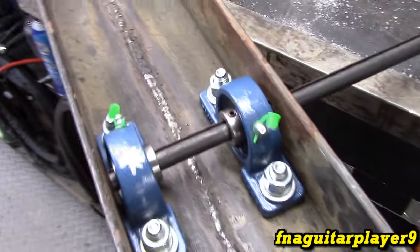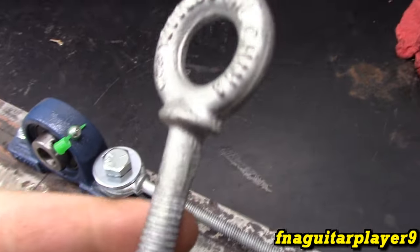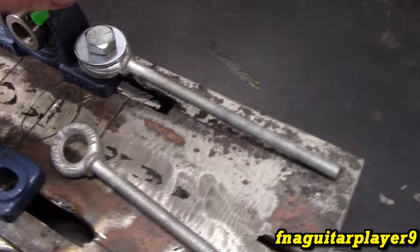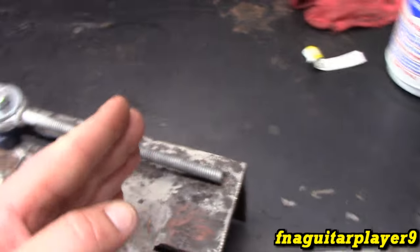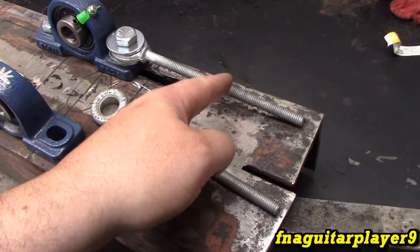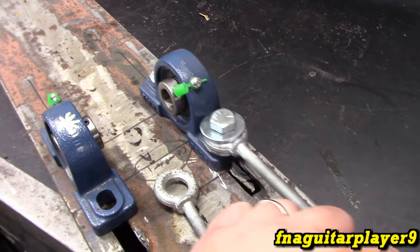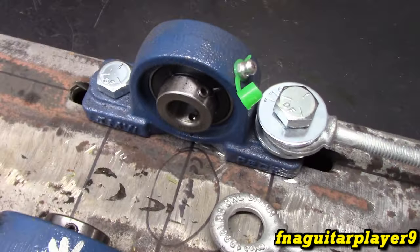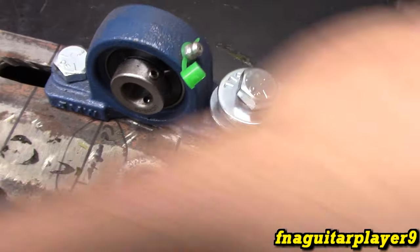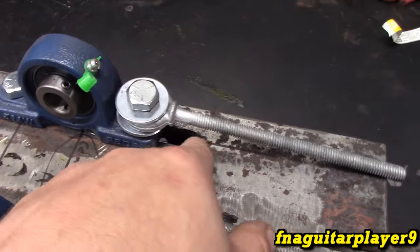It's now April 2nd - just doing a little bit at a time on this. This is how the tensioning setup is going to be. I picked up these eye bolts - rated for 1,200 pounds each with a 3/8-inch threaded piece. Should be plenty strong enough. It's going to be like this with a washer on the top and bottom, with a piece of angle iron welded on the bottom side with a hole drilled for this to slide through. I've got that much adjustment either direction - should be plenty of room. If not, I'll open the slots up a little bit more.